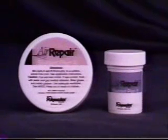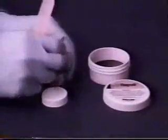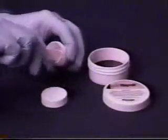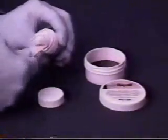Air repair sealant comes in pre-measured cups to ensure the proper resin ratio. The mixing cups are well labeled as Part A and Part B. Part A is a black paste resin; Part B is an off-white paste curing agent. This is a fast cure system and Parts A and B must be combined, mixed, and applied quickly. The uncured resins can irritate the skin of some individuals and rubber gloves are provided. Scrape the complete contents of Part B curing agent into the Part A resin container cup. Fold in and mix with a mixing stick for about a minute until the paste is well blended and the color is uniform.